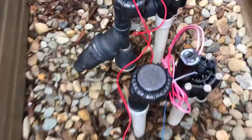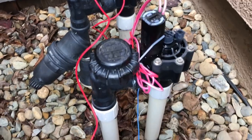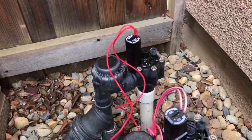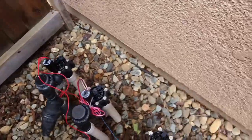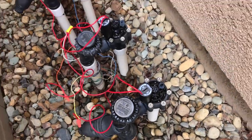It activates this solenoid, which turns this valve on and off through that panel. You can see one of these valves is not hooked up at all — this used to go to a front watering system that is no longer there; I changed the front yard and disconnected it. But this is the basic setup. I've got three wires: the yellow, the orange that hooks in here, and the blue wire. I've got three wires to hook in plus the common.